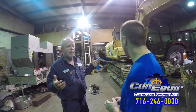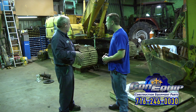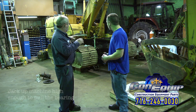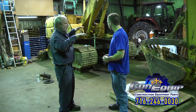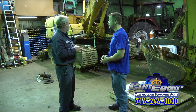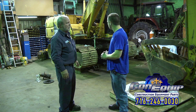You just have to be extra careful and do it as safely as you can when moving everything. The next thing we're going to do is jack it up, take the blocks out from under the tracks, and start removing the bolts to separate it. We'll let the top stay still and ease the bottom down to separate it, then take the last few bolts out and swing the swing bearing out.